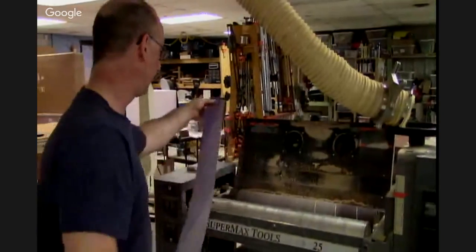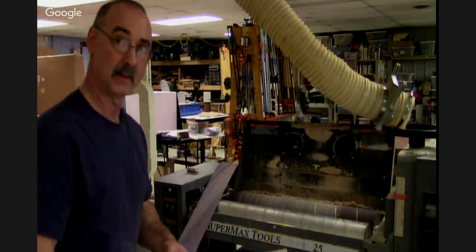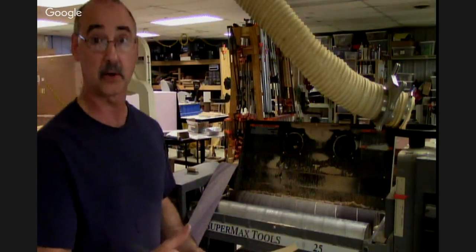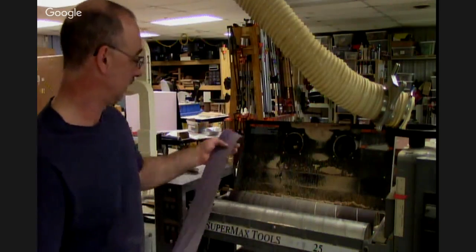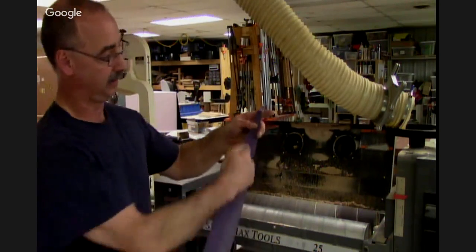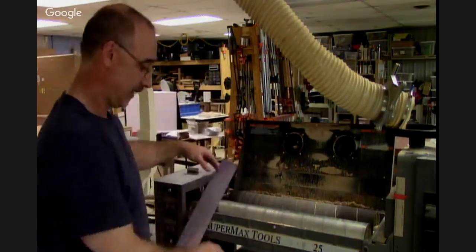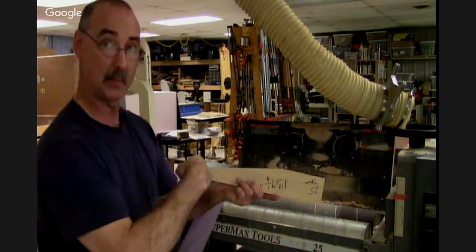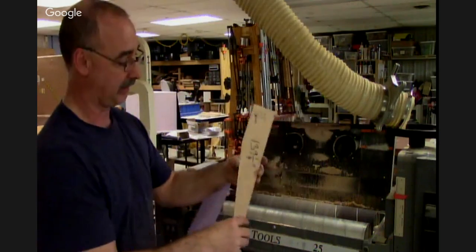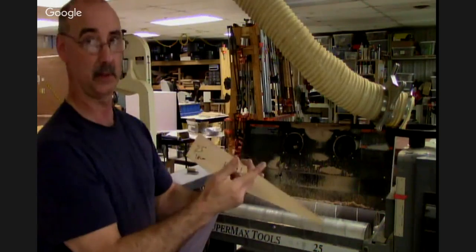So let me show you. You can stay where you are. I know right where my template is. One of the things I did is I found, in the owner's manual for this machine, a layout that said the right angle for this piece is so long. In other words, it allowed me to establish what that angle is. I laid that angle out on this piece of plywood and cut it. I trace this onto my abrasive rolls when I'm going to cut my pieces. This number, 139 and a quarter, is the length of pieces for this machine. They'll be shorter for your machine.